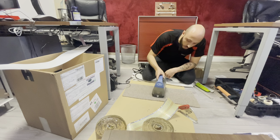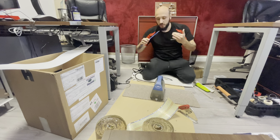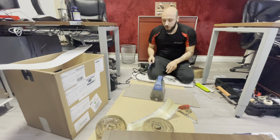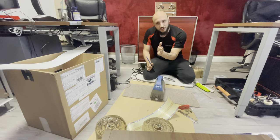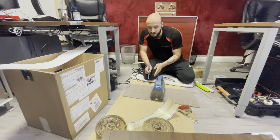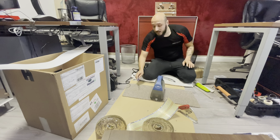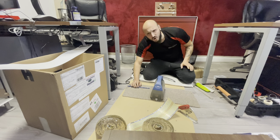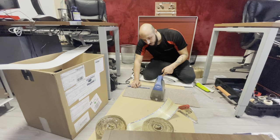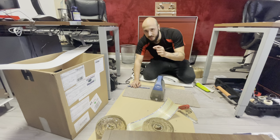Yeah, perfect. So then what you want to do is, whenever you're doing a longer seam, you want to mark, so you should find a roll, just so your KOOL GLIDE is set straight, because you can't see the joins underneath. So you want to find a roll and make sure your KOOL GLIDE is set straight, so when you're coming down, you're following that roll. Secondly, you want to put a pen or anything on the last roll, so when you come to the end, you know where you started and where you ended, because you don't want to miss a bit.